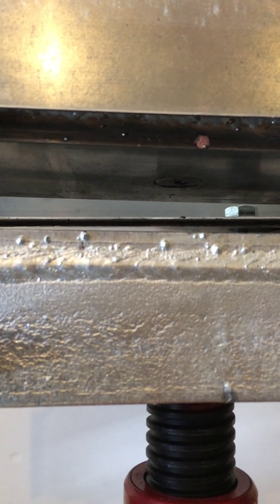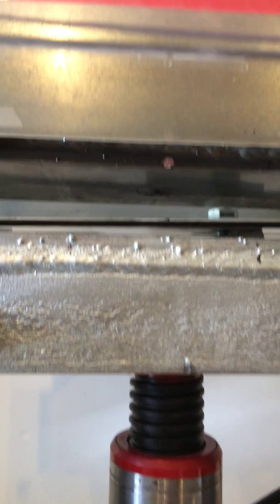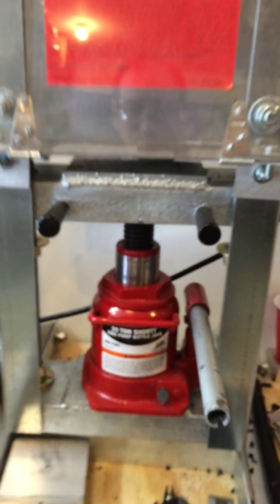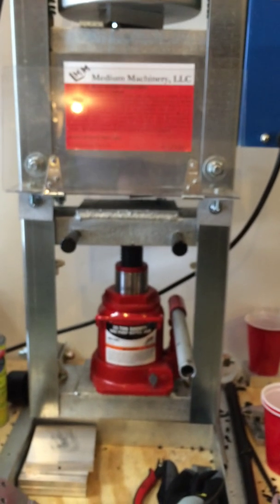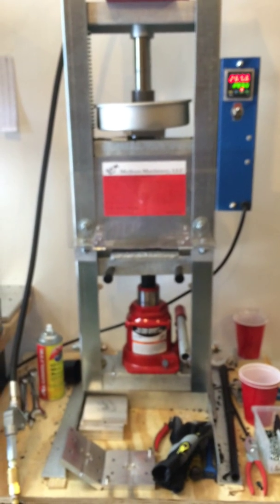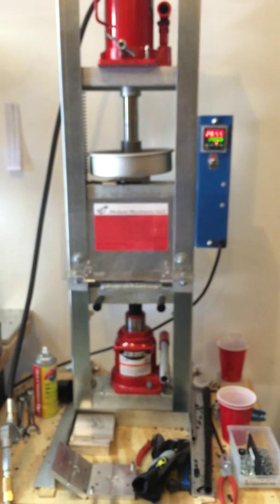And although you may not be able to see it, there's a nozzle where the plastic comes out. It goes through the screw and into the mold that's clamped here. This other jack is also a 20-ton jack pushing as what they call the clamp force — the mold clamping device — that keeps the two halves of the mold together and pressed up against the injection.